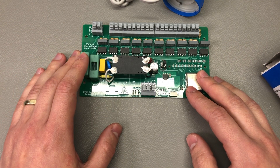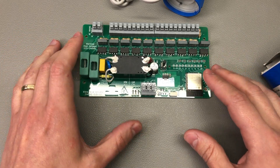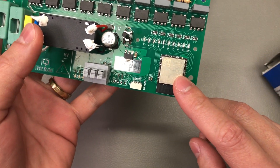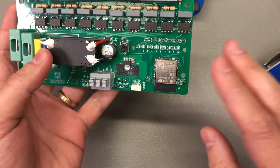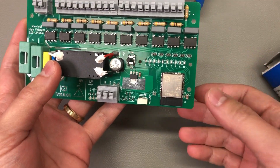I knew I wanted to use the valve actuator system in my home automation setup, so I designed it to be based on an ESP32 microcontroller, making it Tasmota compatible. I use the open source project Tasmota to flash all of my ESP-based smart relays and sensors that I have in my home.